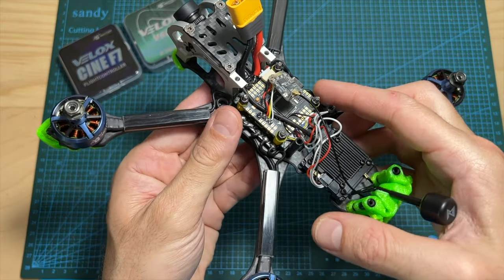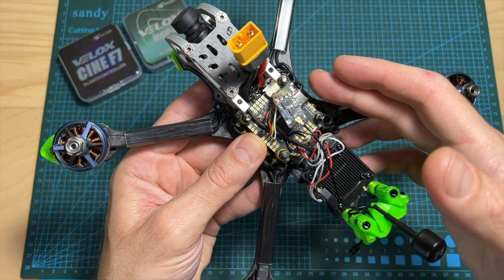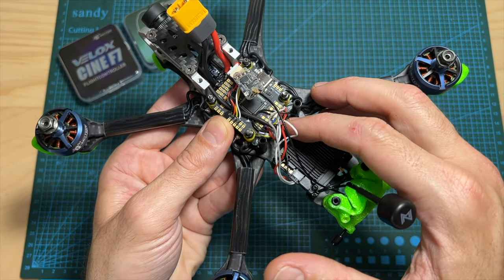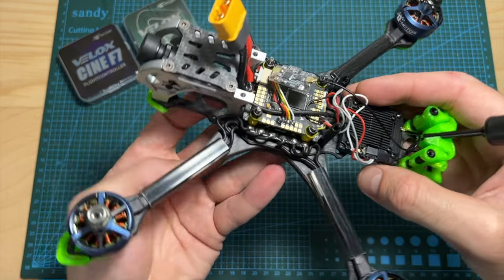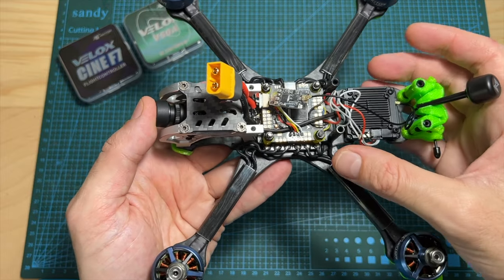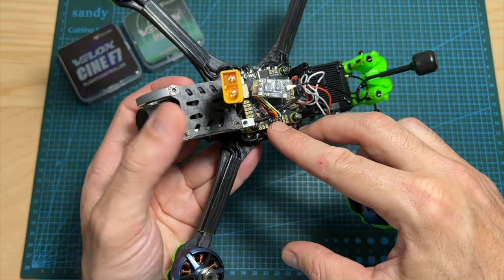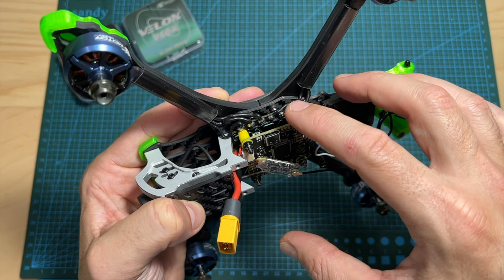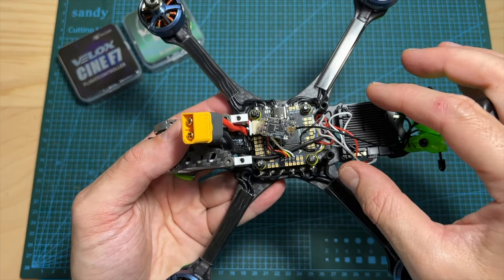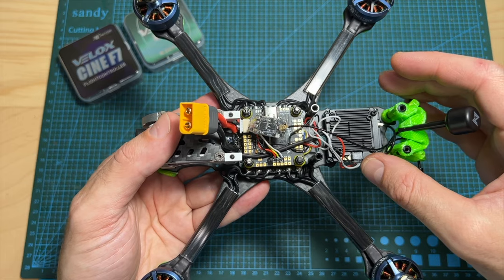As far as I can tell, this is a pretty capable flight controller, which is going to be mainly suitable for someone who's looking for a flight controller that supports 2 4-in-1 ESCs, as having 2 8-pin JST connectors on the flight controller really helps to keep everything organized. And so far, the only downside that I could find is that the 5V BEC doesn't power up when the flight controller is powered using the USB Type-C connector, which means that you'll need to power the flight controller using a battery in order to be able to power up the radio receiver and other peripherals, including a GPS.